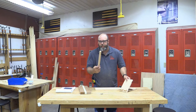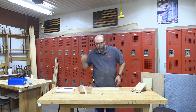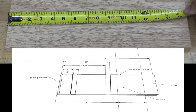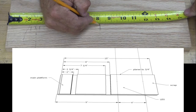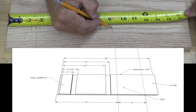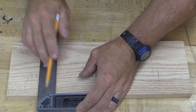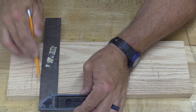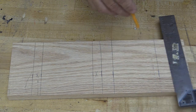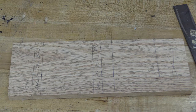This little holder block can even be an offset color, so be creative and use up some scrap wood. Referring to your drawing and measuring from one end, our low point is at 2 — put a mark at 2¾, which marks out where the lower dado goes. The height of the upper one is at 8, so go back ¾ inch. The total length is 9, and then from there our stand is 4 inches, so put a mark at 13. Use a square against the edge — don't free-hand this. Mark the X's for scrap and square the dado lines across the edge so they're visible when the piece is flipped over.